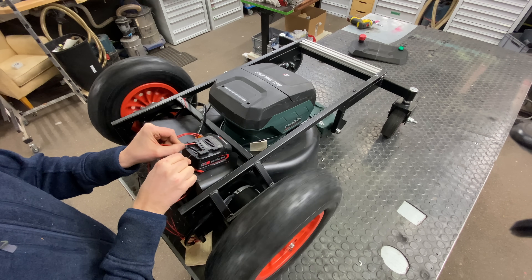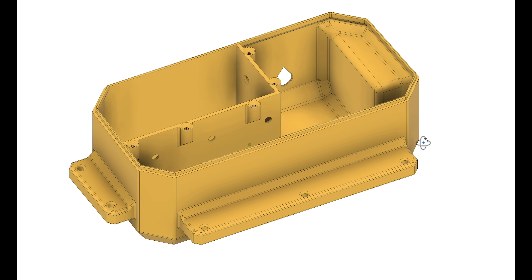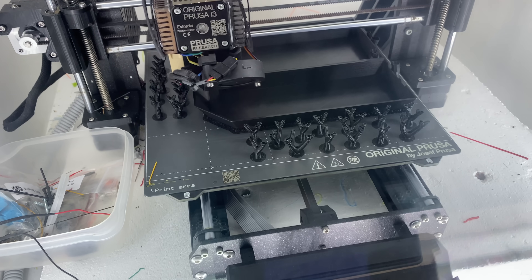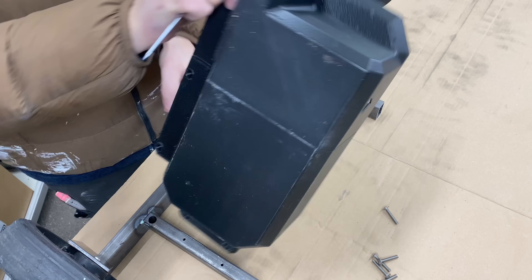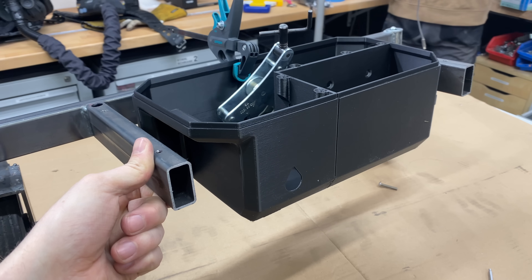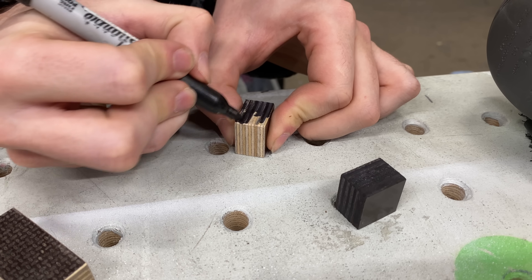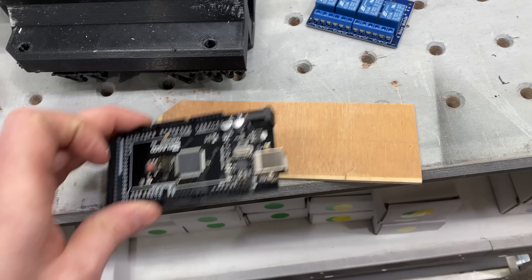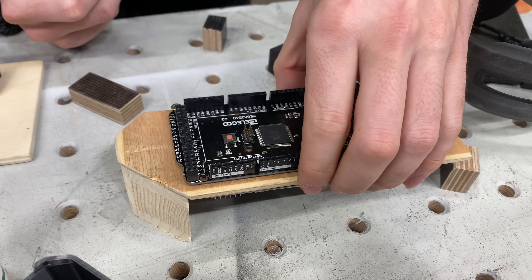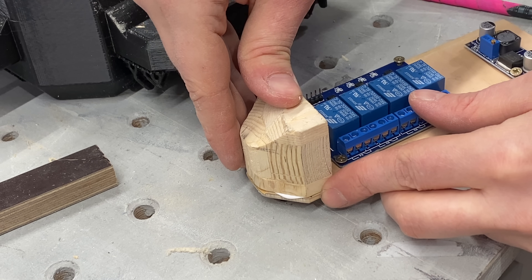Back to the lawn mower. I quickly hooked up the motors to a battery pack to see how it looks when they're spinning and I think it's very promising. Now it's time to add all of the electronics. I designed this box in CAD — first I thought I could make it out of steel but then I decided I'd rather 3D print it so I can match the aesthetics of the lawn mower and it will look much better. Next I added all of the electronics, screwing everything to little wooden blocks that get glued and screwed to some plywood pieces. The plywood is easy to arrange the electronics on and you can't get a short because it's not conducting. I'm adding a little standoff so I can add PCBs on both sides to save some space.